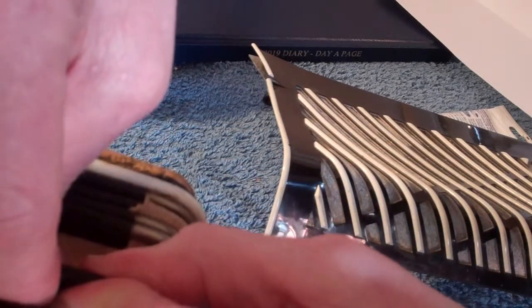Right, we're now back to doing the bellows repair, and although it's not completely dry, I can see that certainly the edges of the Copydex have dried. So what we're going to do is we're going to stick it on to where we need to. Let's position this so we can see. And actually all I'm doing is I'm just positioning it over where, pushing it down, and I'm bending it over. Like that. Just like that. Hold it for a few seconds.